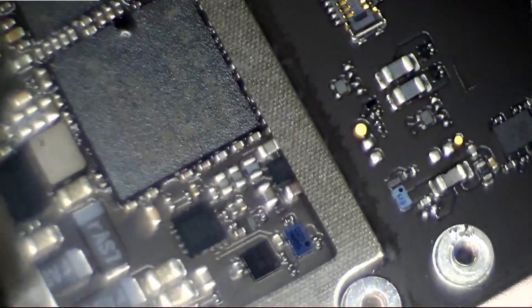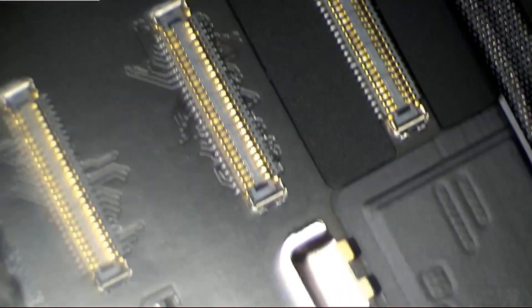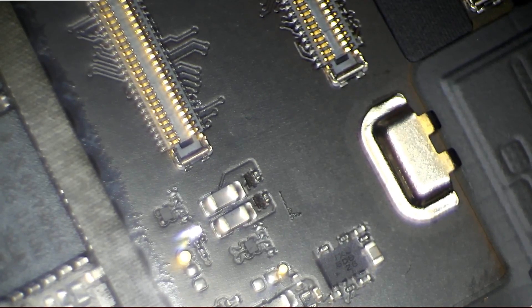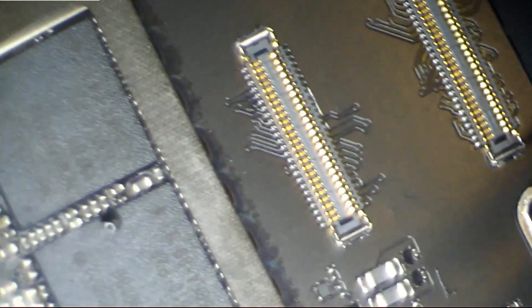I think it's time we took this to the microscope. We're over the microscope now and I'm just going to be looking through here, seeing if I can recognize anything from previous circuits on these things, to get an idea of what might be going wrong. I'm looking for any obvious signs of damage, burned-out components, or anything like that. Here we are — these are the display connectors, they all look good. I'm not sure what some of the other bits are — this capacitor, not sure what that is, but we could come back to that.